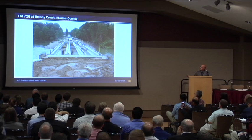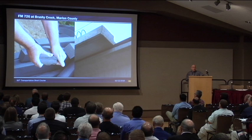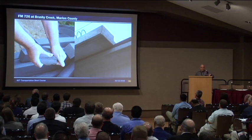This is the polyurethane foam that's used as the dam to keep the concrete underneath the panels. Originally it was supposed to be a polyethylene, but the contractor bought the wrong foam. We went ahead with it as long as the adhesive didn't adversely react with it, and we found out later it didn't work really well. As you can see, the foam is compressed, and we want that compression. The foam is not used to hold the panel up — the foam is used as a dam. That's all it's used for.